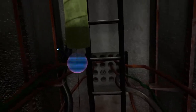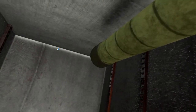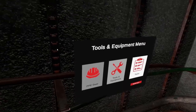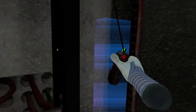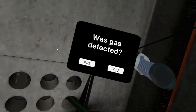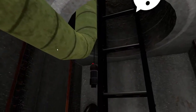Safety is just as important down in the manhole as it is above ground. Go ahead and start the safety setup down there and I'll keep watch up here. I will keep an eye on the blower up here to make sure it doesn't get obstructed. Test around the corners and duct openings for gas. No gas is detected but we need to continue monitoring the air you breathe while in the manhole. I'll raise the gas monitor to face level.